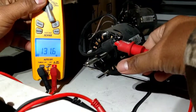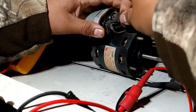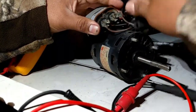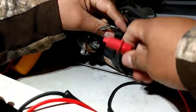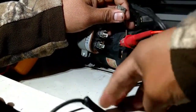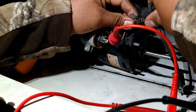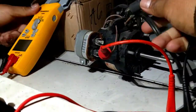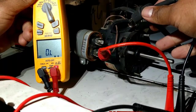That one's about 131 ohms. Let's check out the start windings on this one too. The new one was at about 320-something — let's see what this one's at. 320-something? Hell, this one's OL as well.